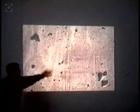These other holes, which are particularly thick, are very unusual in shape, and therefore you're looking for another cause of that particular flaw. When you look into those holes, you find the aggregate pieces with no cement mortar filling the space between, but an arching or bridging action. That's a problem known as aggregate bridging, which is caused by there being too much intermediate size aggregate in the grading of the materials used.